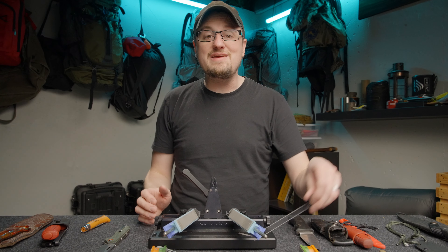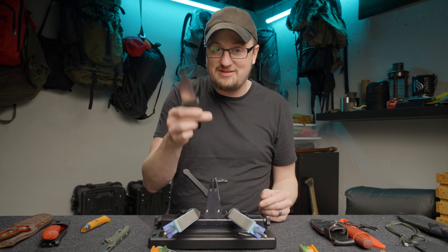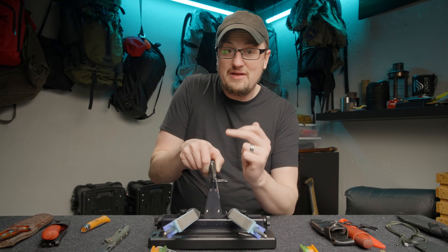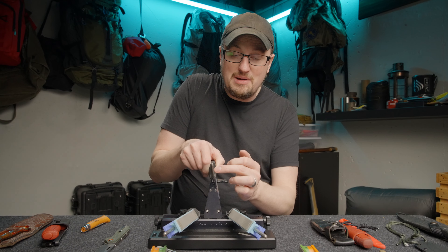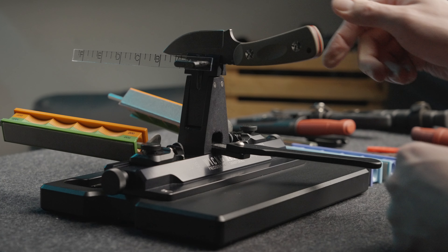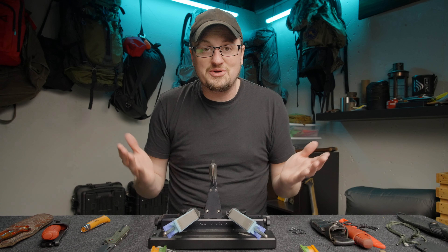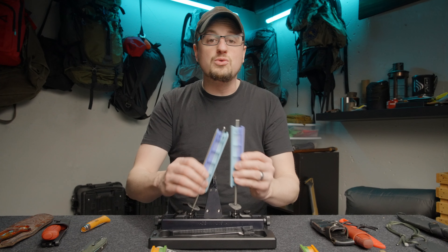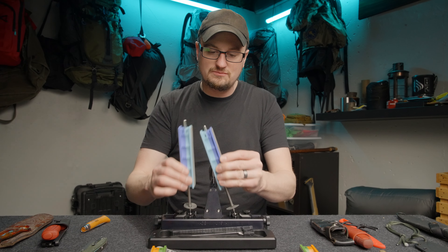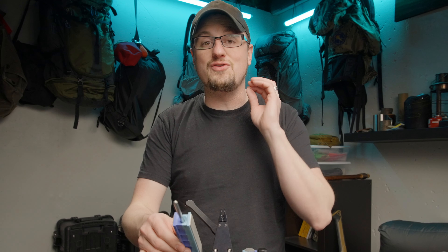It just seems like they've thought of everything. They even give you this scale — this ruler — that pins into the vise and allows you to set where the blade should be exactly for sharpening. I like to set it where the belly of the blade transitions to the point; I set the belly right above the letter A, then I just clamp the vise down. I set the angle on my micro angle drive screws — it's perfect every single time. And it's really easy to touch up a blade quickly with this system.